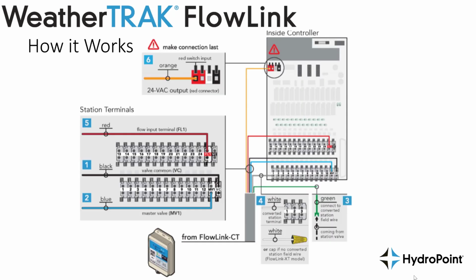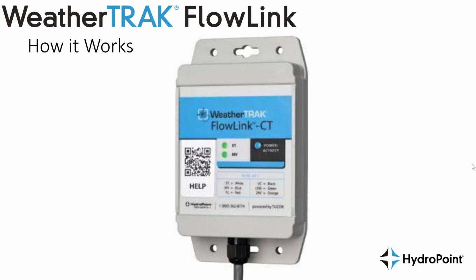As I'm sure by now you've come to expect, in the Flow Solutions Guide there is a wiring diagram for the CT that does a great job outlining where each wire from the CT gets plugged into the board or attached in the controller. And in addition to that wiring diagram, there's wiring directions right here on the front faceplate of the CT, where it spells out exactly how each wire on the CT should be connected.